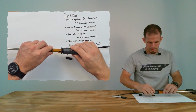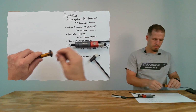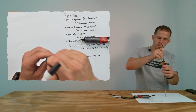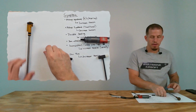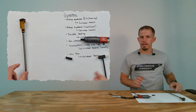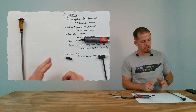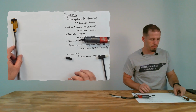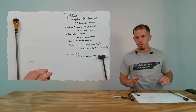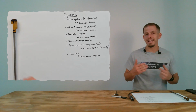Now we go, okay. There, the spring on the nozzle did not compress at all. It popped cleanly past the lips. And that's probably about right. And we can try that. But if you put it together, you try that, and it's not working great the first time, don't freak out. It takes some getting comfortable with the system and developing a feel for exactly where this tension should be. It's very easy to adjust. So let's talk about some of the symptoms of either being too loose or too tight, and how to interpret that and get dialed in pretty quickly.